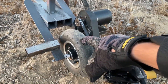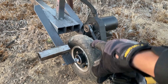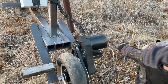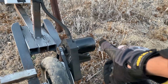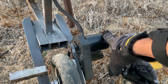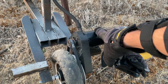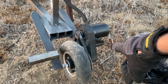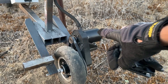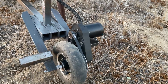This rear wheel is also a scooter tire meant for a stand-up scooter. I don't know if it's meant to go this fast or handle this much weight and it does get a little bit warm when I use it. Same thing with the motor — the limit I set is a draw of 60 amps, and 20 amps when braking. Originally I had it set at 80 which was very torquey, but the motor started getting really hot during uphill rides so I toned it down. I still have to be careful with power usage otherwise this motor gets pretty warm.